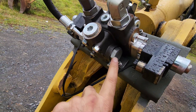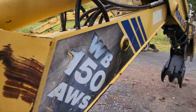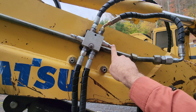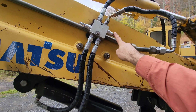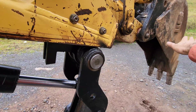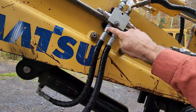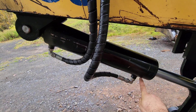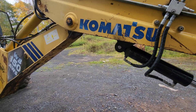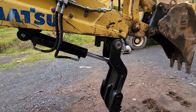After going back and forth with Summit, who were really no help — they kept saying it would work — I tried everything. They gave me a closed center plug; I installed it, relocated my hose connection, did everything I could, and nothing worked. The only thing I could get to work was what they call a crossover cushion valve. It has pressure relief controls on both sides — this one controls relief from this side — so when the bucket curls against the thumb, you can force the piston back. It takes the fluid and pushes it to the front of the piston to help bring it back, rather than dragging the fluid all the way back to the machine.